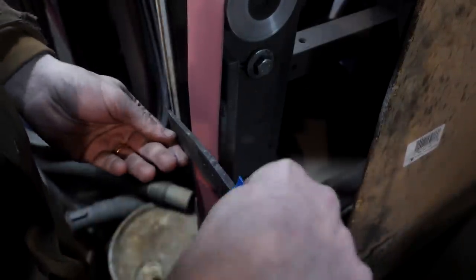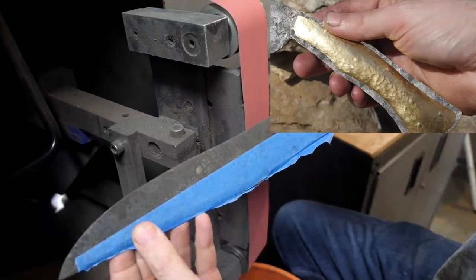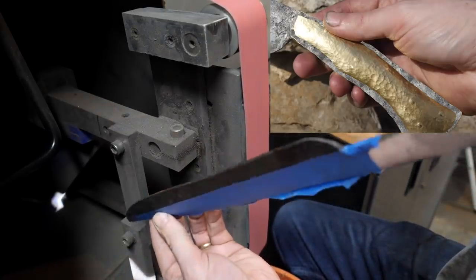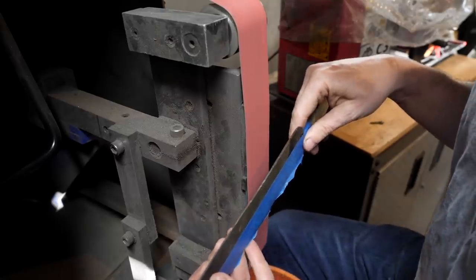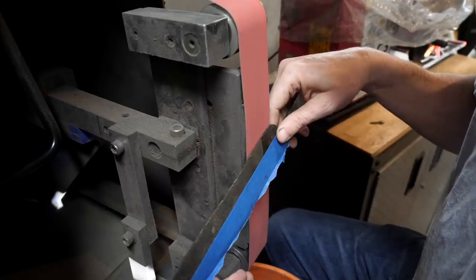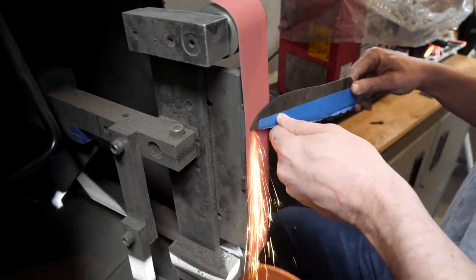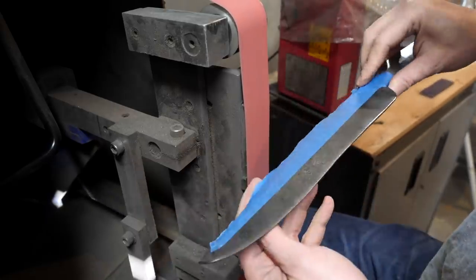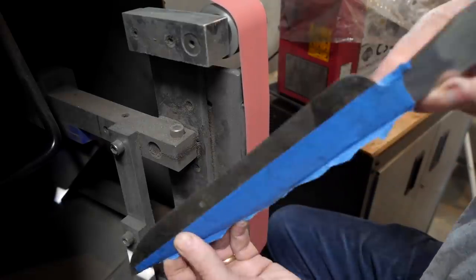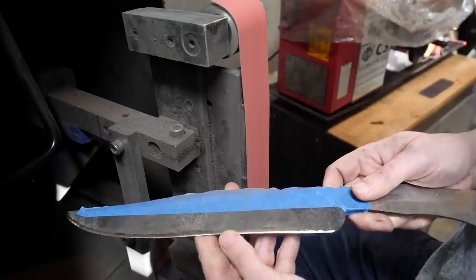I really wanted to maintain a forged finish along the sides of the handle and recess the brass away from that so it's framed by a forged finish and you just have that bulging or rounded part attached to the sides of the handles, but I didn't tell Alex that this was my intent. Since I didn't tell him that, these handles will require a small amount of grinding away of forged finish to make the surface fit flush with handles, and keeping that sanded area exposed wouldn't really match the rest of the forged finish on the blade, so the entire handle will be covered with brass. No sweat, still gonna look good.